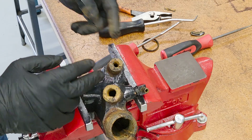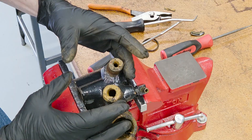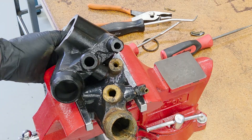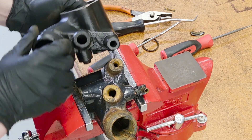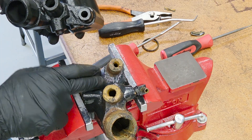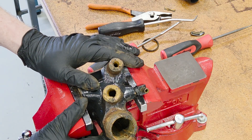Here's the original housing — it's corroded where the hoses come off. The problem is that the water going through this housing corrodes the inside of these two passageways. As the cast iron oxidizes, the passageway gets smaller. You can see the difference in diameters pretty easily: one is probably almost a third larger on the new one, and this one is almost double the diameter — it's really corroded and closing off. Much like exhaust risers, I would look at replacing one of these every 10 years. It needs to come off every two years to change the thermostat — especially in salt water. In fresh water you can probably get away with 10 years.